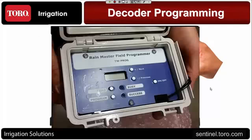Now, if I do this from the handheld programmer, and I apologize for the glare on this photograph, but I think I can get the message across here by looking at this. The 2 wires that are coming out of the bottom right are pretty much that pigtail alligator clip. You can't see the alligator clips, but they're on the end of those 2 black wires right there. One of them is labeled for the red, the other one's labeled for the black. So you attach it to your 2 communication cable wires to your decoder. You turn the programmer on. This runs on a couple of 9-volt batteries. So I can do this either in the office, I can do it out in the field, I can do it in my vehicle.